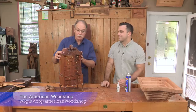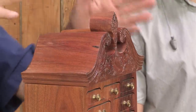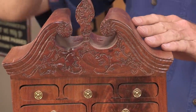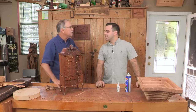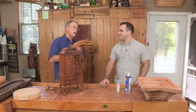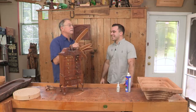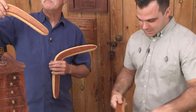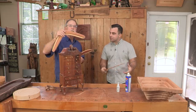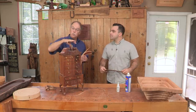Where do you come up with patterns? You can go to the American Woodshop website for free anytime. Also, this broken arch pediment right here is one bandsaw technique as well — use an eighth-inch scrolling blade to get this fine detail. You just bought a bandsaw and you're breaking down rough stock — well, here's my favorite project of all time: boomerangs. Patterns are on the website. Follow the plan, get out there and enjoy yourself. Most of all, realize a bandsaw tuned up with a good blade can do this and so much more.